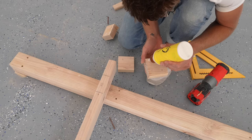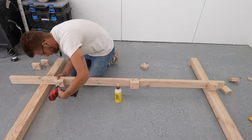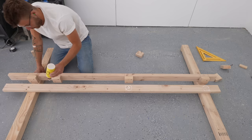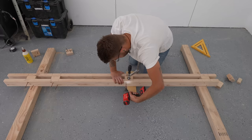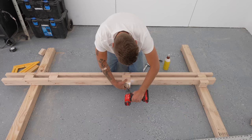Now it's time to assemble this base. I made sure to use wood glue on every spacer and every board where they met, so the screws could hold everything in place and the glue could harden and hold everything together long term. Notice how I put 2 screws in each spacer, and then whenever I put on the next slat, I put 2 screws in facing the opposite orientation. That way they sort of made an X, so I didn't have any screws running into the ones behind it.